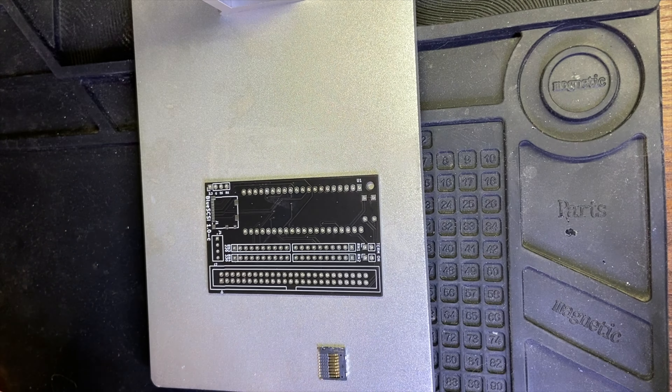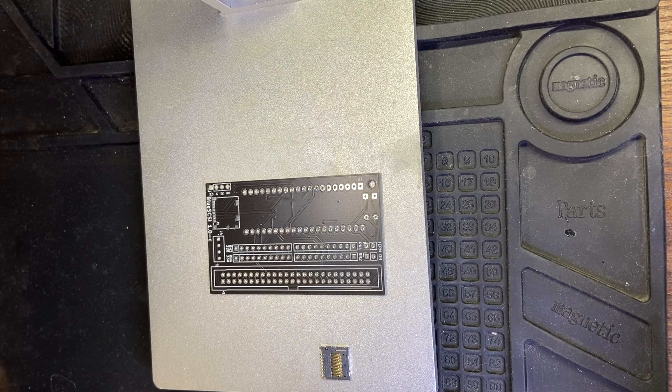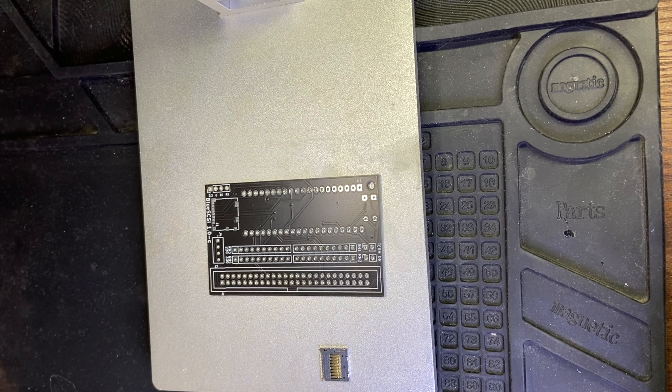The GitHub does talk about the drag method, and you can also look up several YouTube videos of people demonstrating how to use the drag method to solder surface-mounted components. One other thing you will need to do it the way I'm talking about is Kapton Tape — the tape I'm referring to starts with a K. There will be links in the description to any items I recommend above and beyond what is included in a kit for the BlueSCSI. Alright, let's get started.